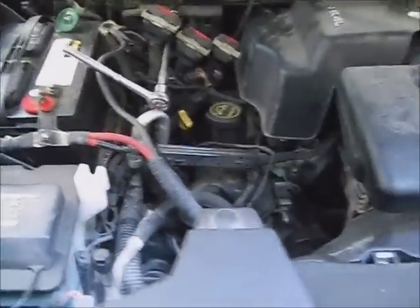I expect the TXV valve is stuck closed. If the compressor can't pull Freon in, it can't compress it out. I think it would just run long enough to start pulling almost a vacuum on the line before the switch shut it off, and then I didn't get any high pressure boost. This refrigerant line was staying lukewarm and it had enough Freon in it. The compressor was working — when it did work, the pressures were good running off the auxiliary. When the back doesn't work, the pressures aren't very high and the low side almost goes to about 10-15 pounds before it shuts off.